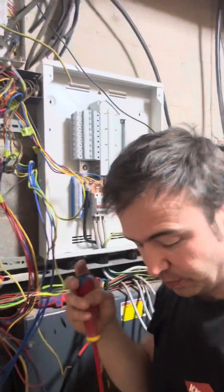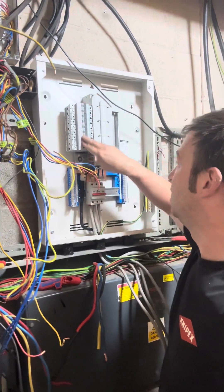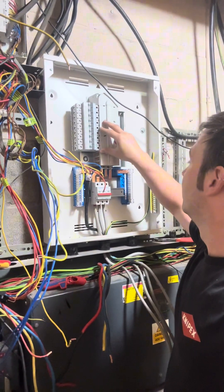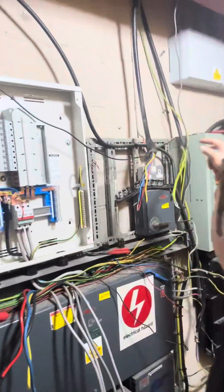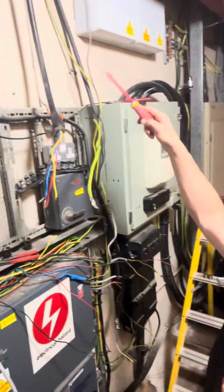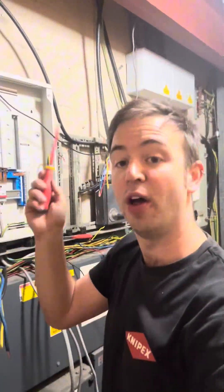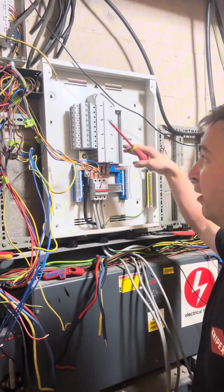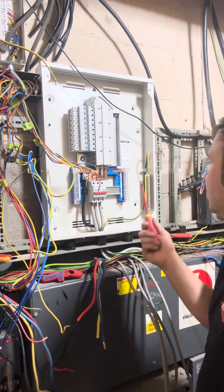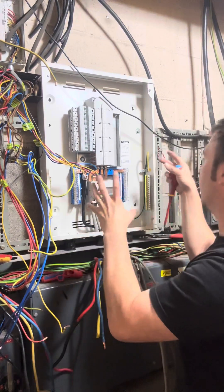We did an EICR on this place a few weeks ago. This is just high bay lighting, hence why they're not RCBOs — they're just MCBs, 10 amp MCBs. But the board needed upgrading to allow for other things. They've done some more work; we've done some work in the main panel where we needed to relocate a couple of supplies of other boards to make room for new supplies for other areas of the building. Hence why this one has to be upgraded — we incorporate a few as part of the EICR remedial work and future-proofing of the installation.